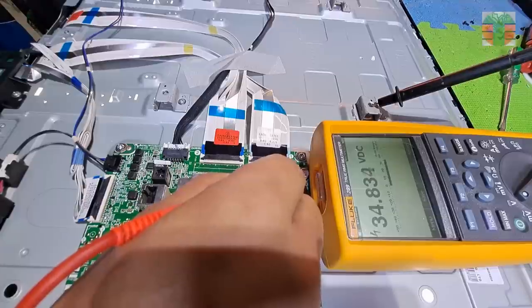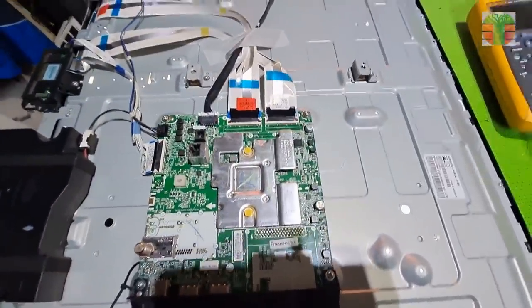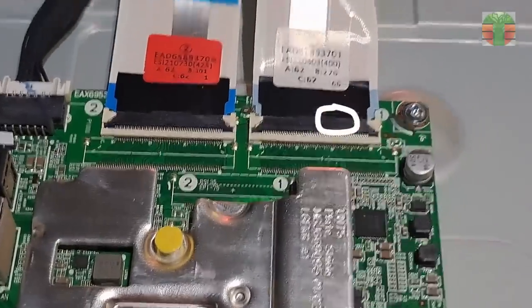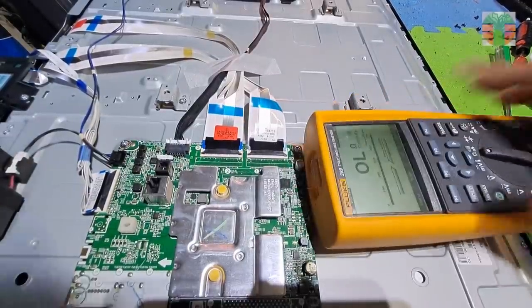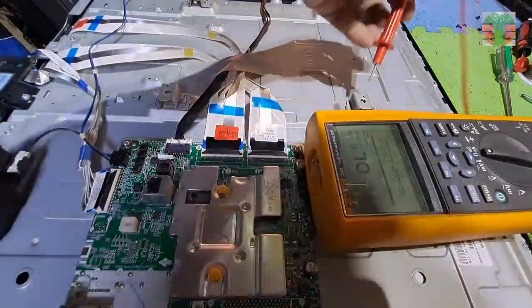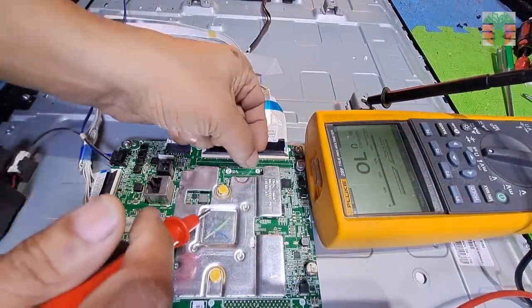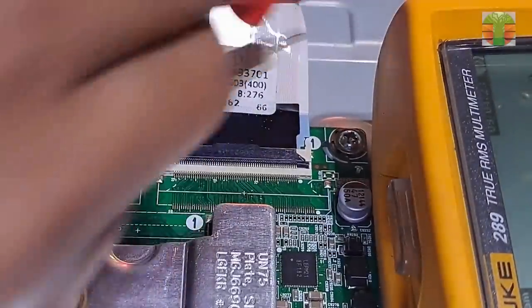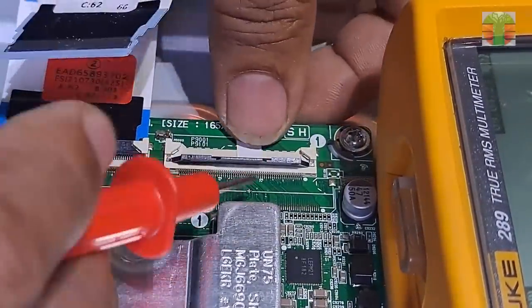The VGH voltage is turning on now, but we still don't have an image. The short circuit line is somewhere here in this area. Let's remove the paper and test some of the lines,